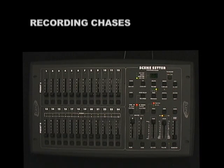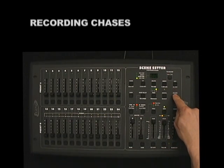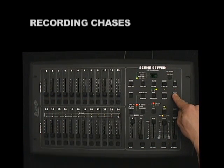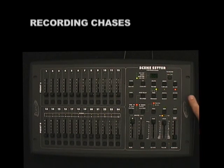To record a chase, enter the record mode by pressing the record button followed by your password using the flash keys 1 through 12 or 1 through 24. I previously set my password to 5678. Once in record mode, your red LED should illuminate.